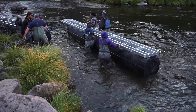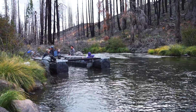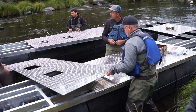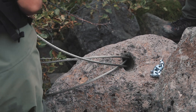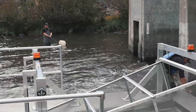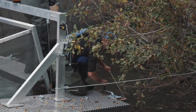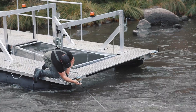These traps are installed very similar to a rotary screw trap. There are two pontoons with cross bracings and decking on top, and they're held in place by leader cables. You have anchor points upstream — either trees, a dead man anchor, or large boulders — that you can secure to on both sides of the channel. With winches on the front of the trap, you can adjust the position from bank to bank and move it forward and backwards.